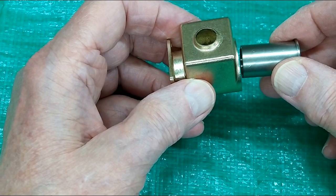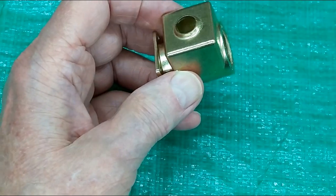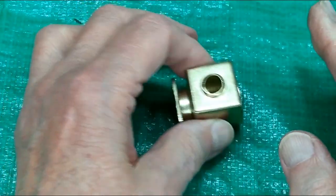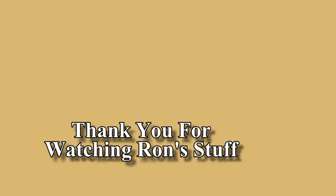When the liner is in there, try to turn it a little bit after it's past the two O-rings, push it all the way in, and then put the head on straight away. Let it sit and cure overnight, and then you can put water in it the next day and see if you've solved the problem.